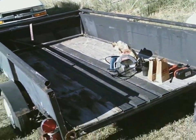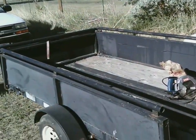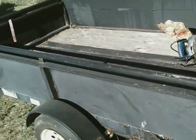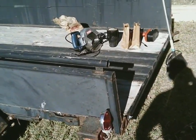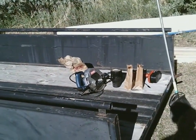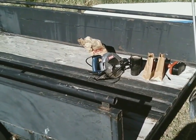You may need to modify the plans for your trailer size. This trailer was thought to be five-by-eight, but the inside is actually only four feet four inches wide, though eight feet long — so the plans had to be modified. You can still build the shepherd wagon on such a trailer as long as it's fairly close in width. Even a four-foot trailer with sides works, but avoid anything less than four feet without sides as it'll be tippy.